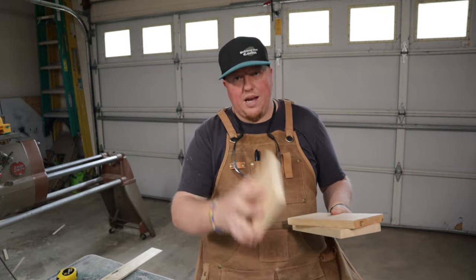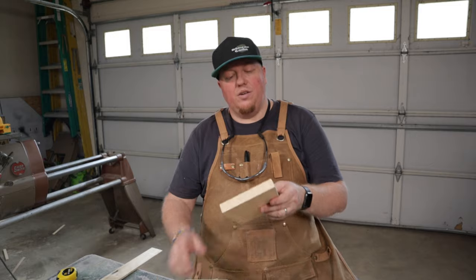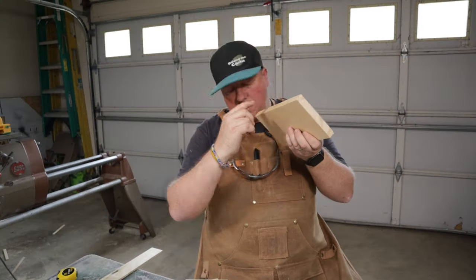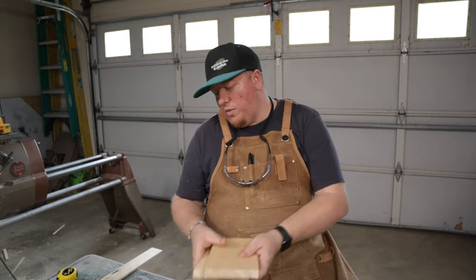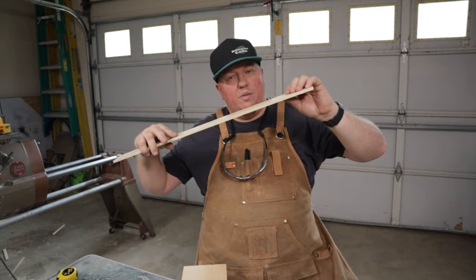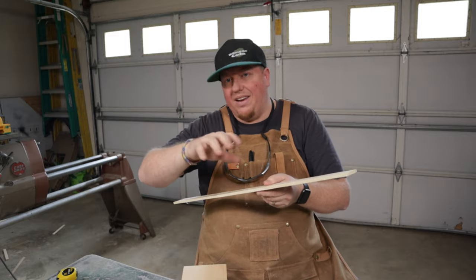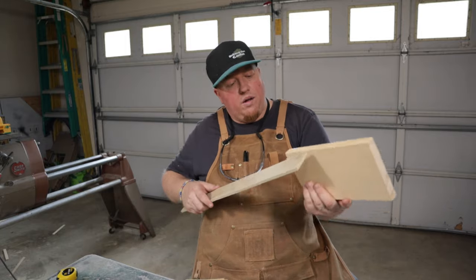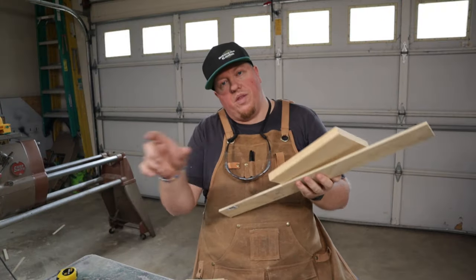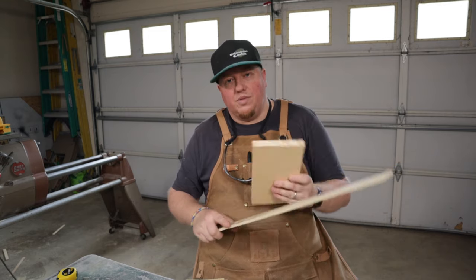Let's start building the outer box for the pieces that are going to slide back and forth. If you don't have another piece of wood in there, when you slide across to get to the combination it could drop down and not work. So I'm going to route this so it will fit right inside into the lip and keep that flush along the top, so when the slide moves back and forth to get the combination, it will not come out.